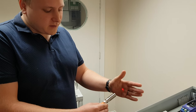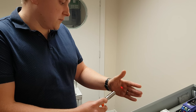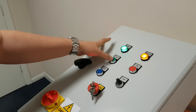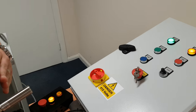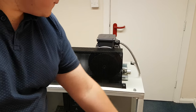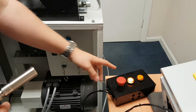Moving a hand in front of the sensor you can see the LEDs come on, sending 24 volts back up into the PLC. If the system is started with the start button and the conveyor is clear, after a couple of seconds you will see the motor turning and the down solenoid will have activated.